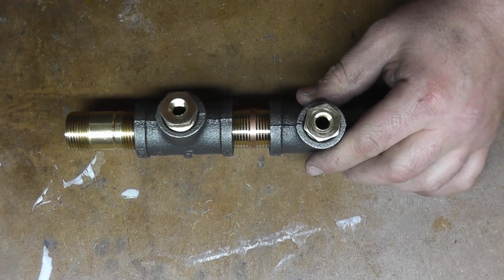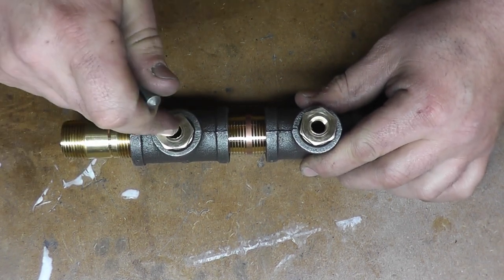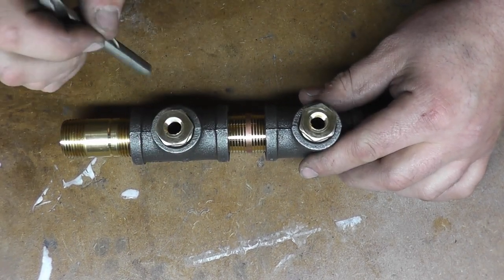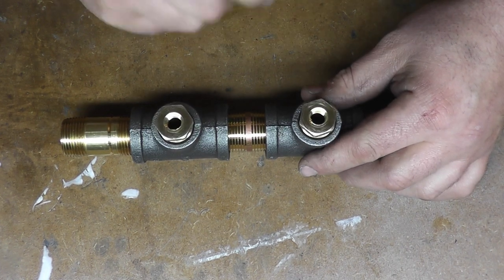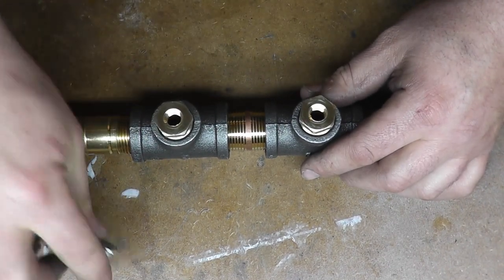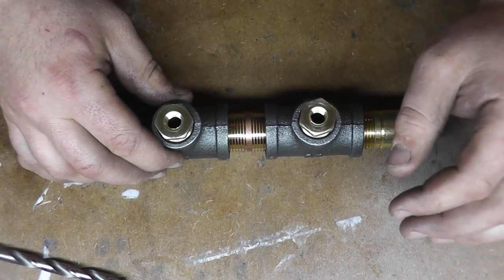Now these holes here, if I take an 11/32 drill, I can pretty much get all of the thread out of there. So I can probably tap these for a 3/8 thread. It's not gonna have as much thread engagement. I mean, it's not gonna be like 75%, probably maybe around 50%. But it doesn't really make a difference. We're not really holding any weight. So instead of having to go up to half inch, I can just do that with 3/8, and that should